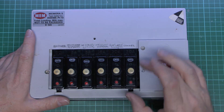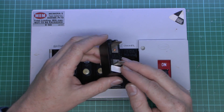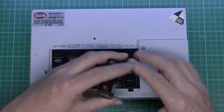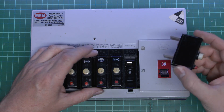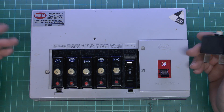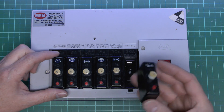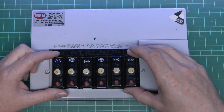These are circuit breakers of the plug-in variety, and quite similar to the Wylex ones from around the same time. The main difference here is that the pins on the back are actually horizontal, with horizontal slots corresponding, rather than the Wylex which had them vertically. The fuses you can put in here are basically the same arrangement, just with 2 dots on the back in the standard set of colours, available in cartridge and rewireable type. These haven't been made for probably a couple of decades, and unfortunately if you want to fit a new circuit you can't buy these, and the Wylex ones won't fit because the pins are the other way round.